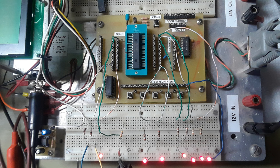The LEDs are what I was showing you in the earlier block diagrams or schematics. The two far right LEDs are the representation of the VHF relays for the polarity switching box. The next two over to the left are the UHF relays representation. Then the two spaced apart in the middle are the two for the preamp power that'll be switched on and off. The one lone one way over to the left hand side is the heartbeat LED, I call it, for the PIC itself, that shows me that it's alive.